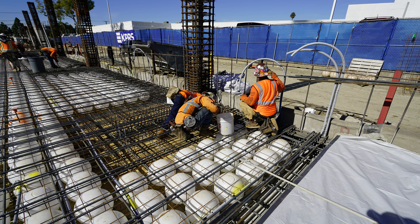Regarding bubble deck — is it possible to use cubic geometry? No. Bubble deck is the technology where you put voided spheres into concrete slabs to make them lighter. With bubble deck, it's circle spheres. The reason is that a sphere or egg-shaped design doesn't have any pain points, so it can be compressed with a ton of force on all even sides from the concrete without breaking.